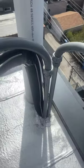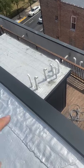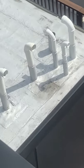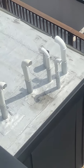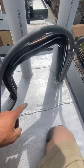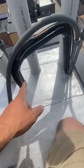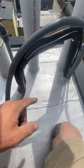There are a few ways to do it properly. One way is to use a modified membrane all around the pipes like the neighbor did, but it's time consuming and you can burn the pipe. We're going to do it differently — we're going to put a one-part sealant which is specifically designed for situations like this, and I'm going to show you how we do it.